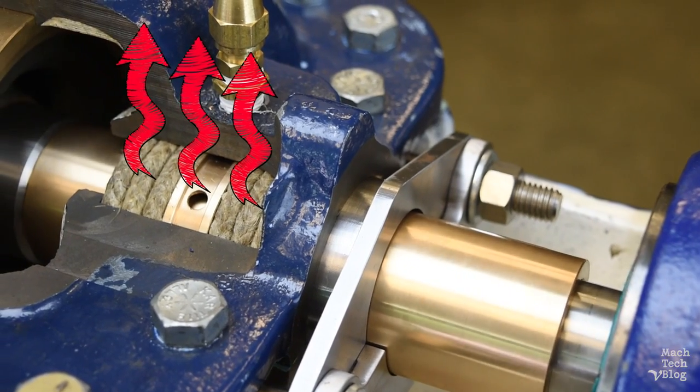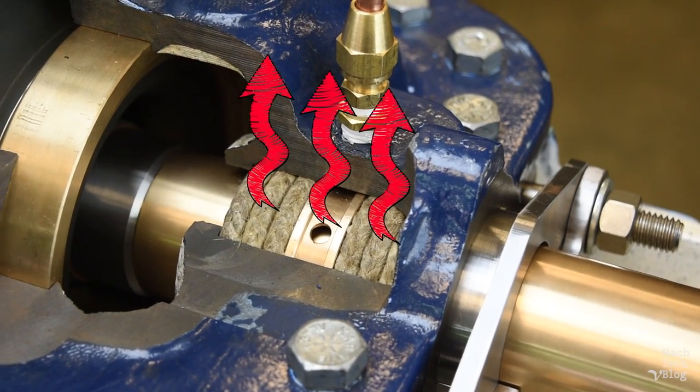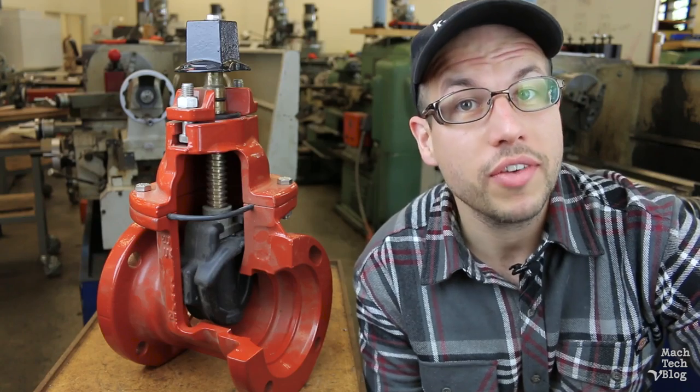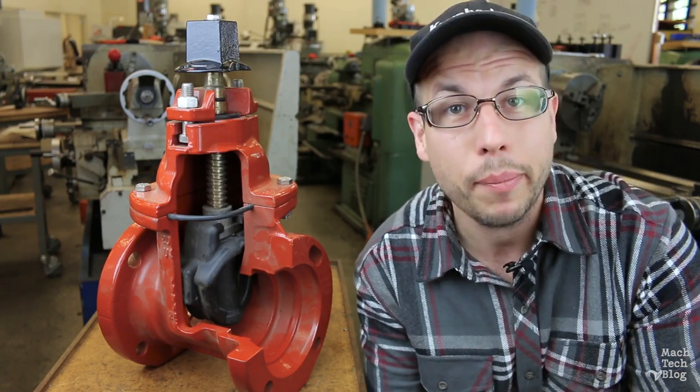Because of the way it forms a seal, compression packing has to grip the shaft tightly during operation, and this inevitably leads to all types of problems. Compression packing generates a lot of friction, which puts strain on motors and produces large amounts of heat that must be dissipated. It's worth noting that packing prevents excessive leakage — not leakage entirely — because packing has to leak a little bit during operation. In an application where there's infrequent movement of the shaft, the packing can be fully compressed to stop leakage entirely.